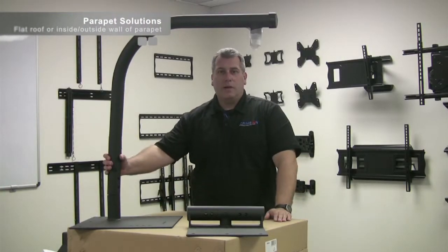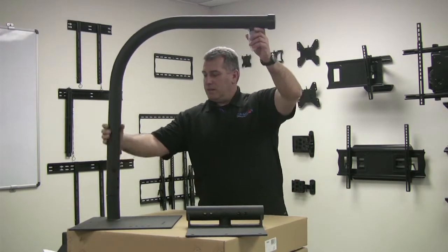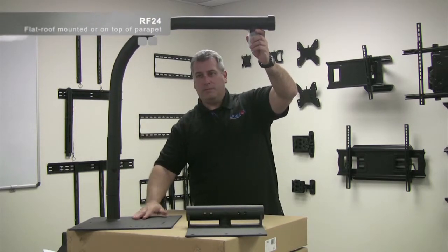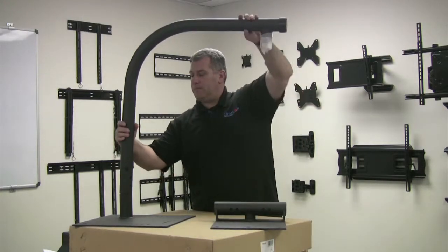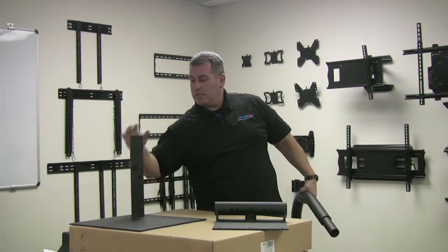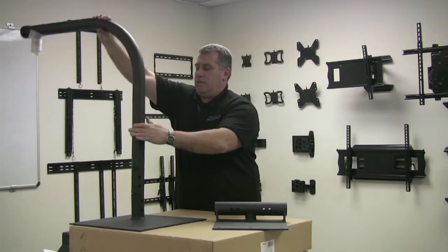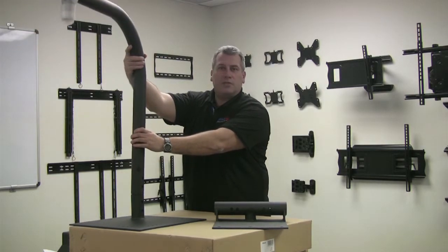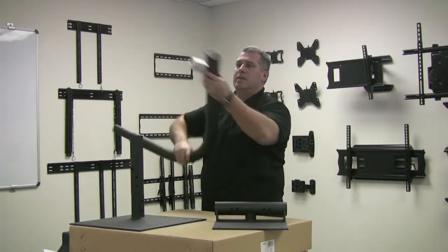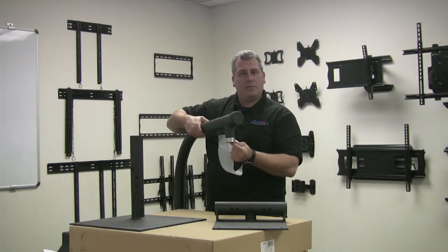In this section of the video we're going to talk about the heavy-duty parapet wall camera mounts from Crimson. Here we have an RF-24 roof mount parapet that mounts on the top of a roof and in the corner so that the camera would mount over the top. We use a standard pole that fits in, that could be swung back for service, mounted at 45, 90, and 45. It has a standard inch-and-a-half NPT mount, so it goes on most camera dome applications.